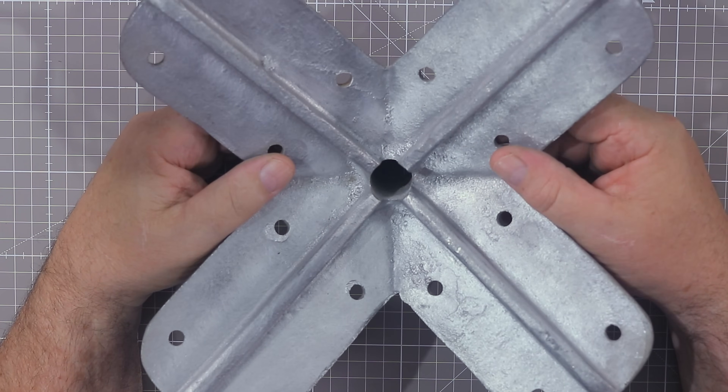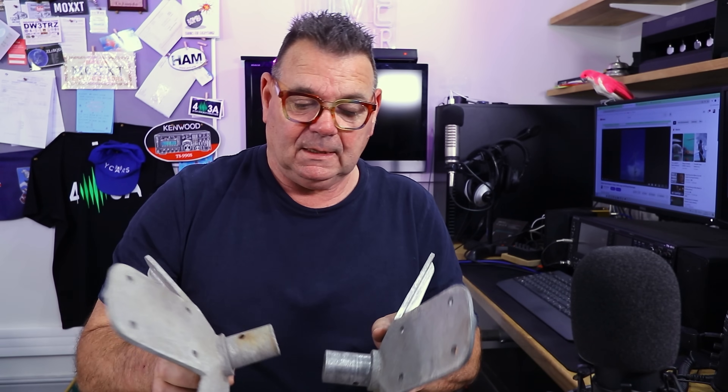There are a few variants of this. Justin owns a company focused on antennas and he's been doing great work on VHF quads — not necessarily square quads either, oblong quads too. He's given me a link to a really up-to-date, very accurate modeling software. At the moment, a boomless quad typically has an impedance of around 110 to 120 ohms. We fix that using 75-ohm coax cut to a quarter wavelength, accounting for velocity factor, which transforms it down to around 50 ohms.